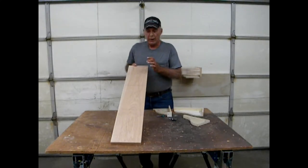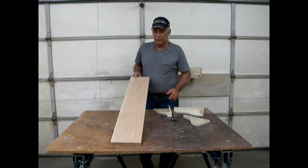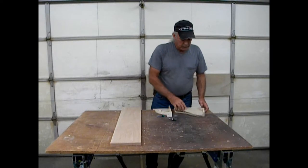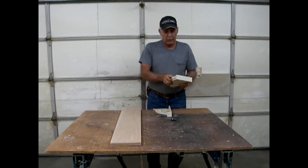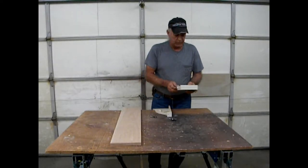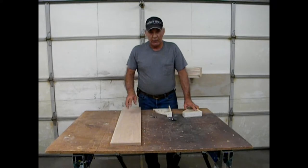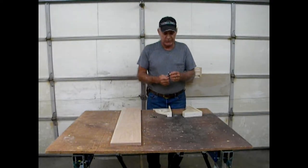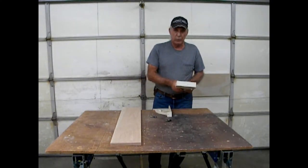I'm going to cut my blanks out, mount them into the sleds, and shape the profiles. One thing to keep in mind: when you cut your rough shapes, leave them a little bit proud of your template so the cutter has some material to remove down flush with the template. I try to leave a sixteenth to an eighth of an inch — not too much so the cutter doesn't work too hard, especially on a router table where horsepower tends to be a little less.